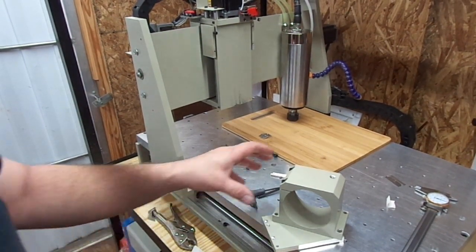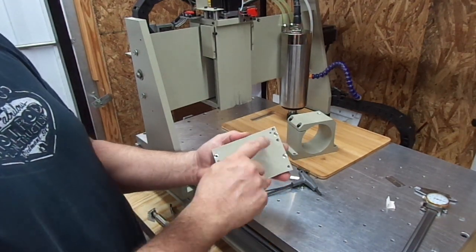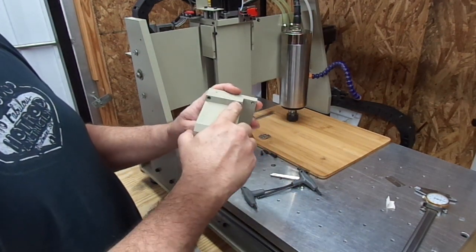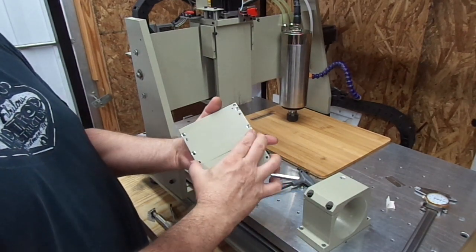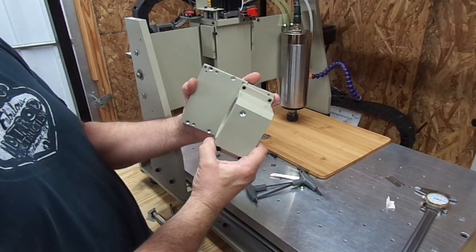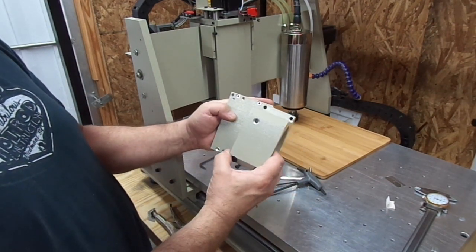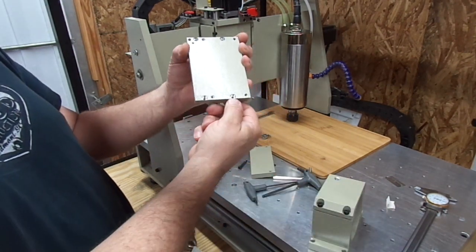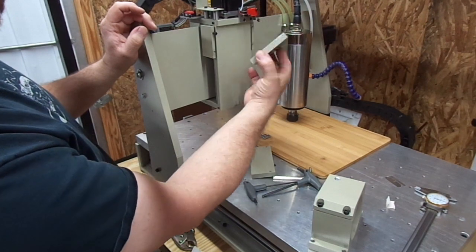Okay, and there we go — back from the shop. This piece got cut off. I originally was trying to use the existing hole, but it lined up with theirs, so I had to work around that. These were the two holes it was in. What I did is move it up to the higher hole and drilled and tapped two new holes. Then there are the counterbores for the screws, so we can bolt that right up and be good to go.